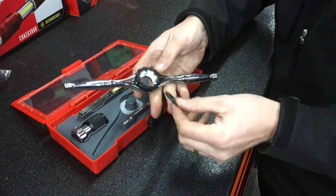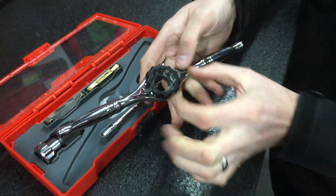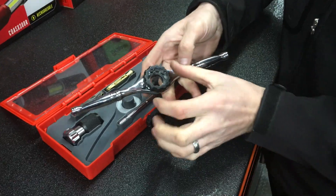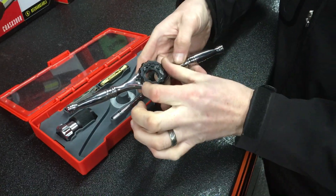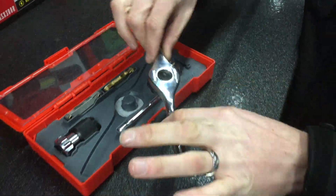If you're using a die, just drop this into the bottom of the holder. This will work with all the dies that have the same dimensions, and it will work on the Snap-on and the Blue Point dies. Just drop it in, give it a twist, it'll hold that die in position for you, and then you can use it as a die wrench as well.